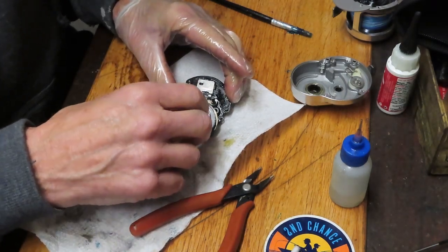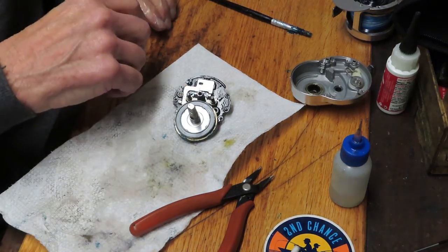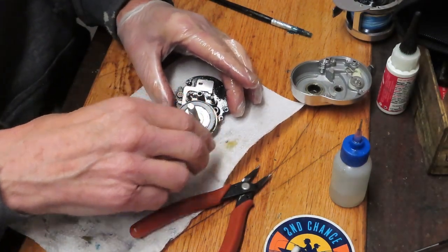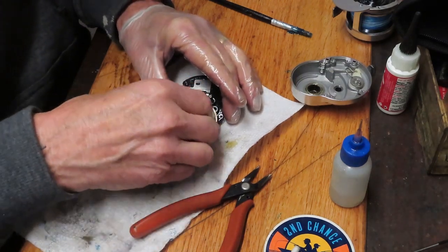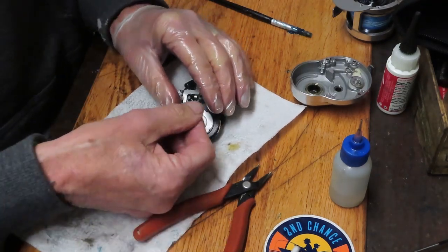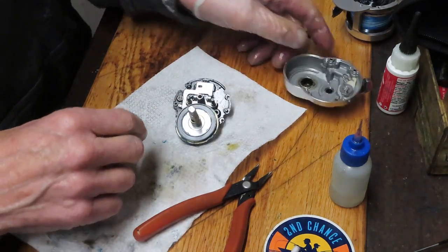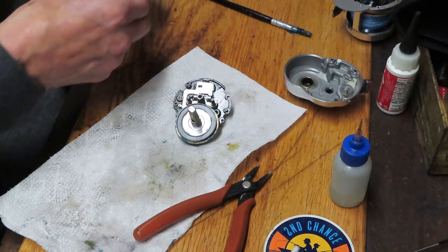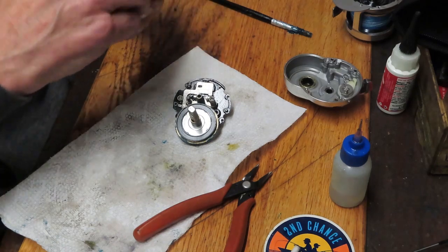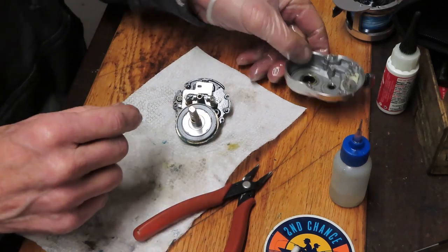So we've taken this inner part completely apart. We've examined it. The only thing we've done differently here, unfortunately. Oh, we're good. Getting ahead of myself. This is where pictures would help. We have that shim washer for the bearing goes underneath here. We have our 2 springs, 1 on each post for the yoke. And then we can close our case.